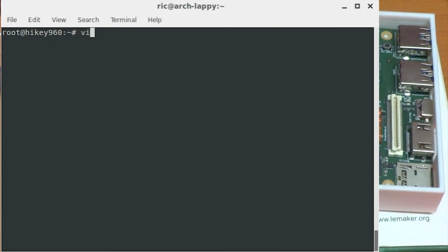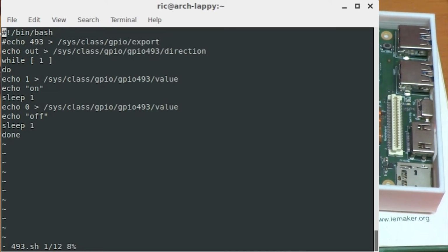So it is a simple sh script, and this is how it looks like. The first comment below the bin bash line is just to be run once, and I have already run it, so there's no point in executing it again. Hence it is commented out. It just exports the GPIO pin number 493, which is the Linux GPIO pin number for GPIO 21, that is on pin number 34 on the 96Boards header for the HiKey960.